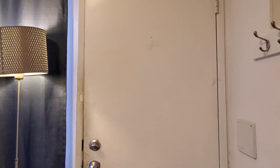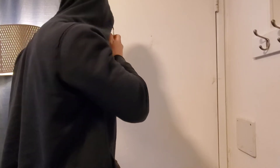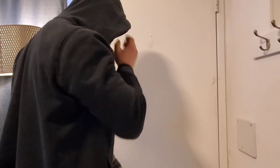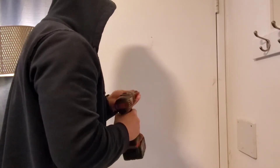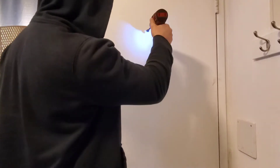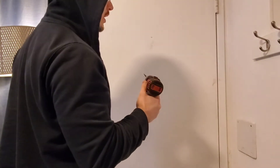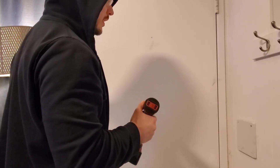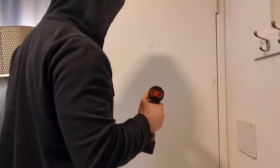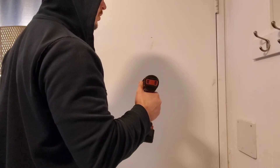So we're going to drill our hole. As usual, put on some safety glasses — I know it's a quick and simple job, but accidents can happen at any time, especially when you're overconfident. When drilling, the important thing is to go straight. Don't go from side to side — this is a very common mistake for beginners. As my bits get dull I tend to push harder, but if your hole is not straight, the thicker the material you go through, the more it's going to be off.